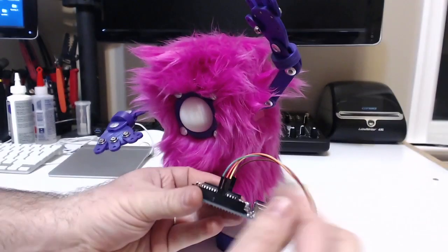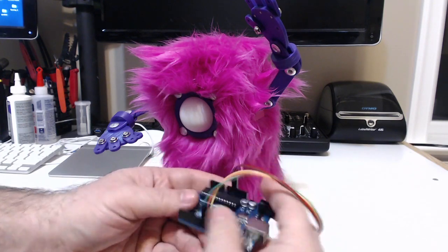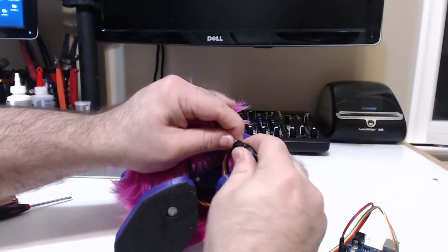And then all of them come down to the Arduino — pins 8, 9, and 10 serve the servos plus the NeoPixel. And again, a single wire there for the power and ground, nice and clean. And we'll take this block apart so we can get into the body.